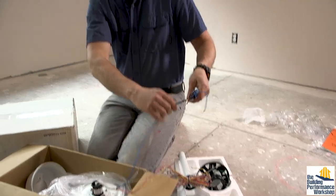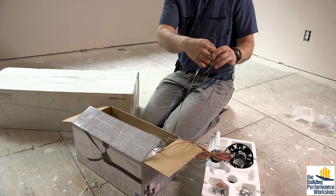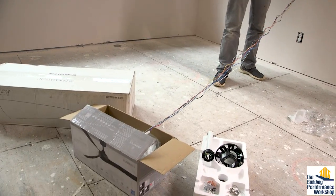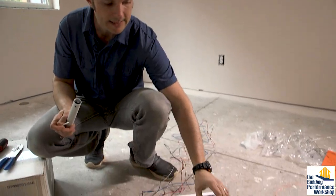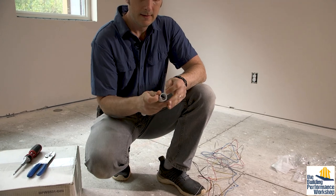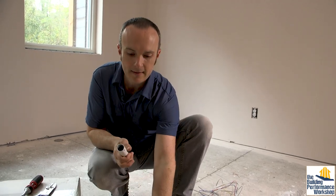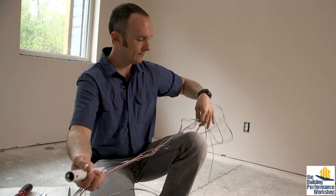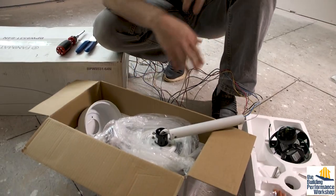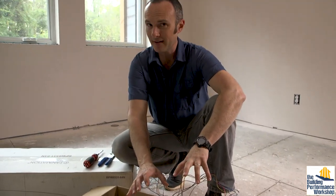These wires are very long because if you used a six-foot down rod, they need to accommodate that. So this is how long you've got and I'm not going to need most of this. The ball that goes inside the cage comes off and there's a little post. I'm going to put this set of wires through this. One of these is a safety cable — since this thing is going to be moving, the amount of things on this machine designed to tighten everything down is a lot, so you will be doing a lot of tightening.